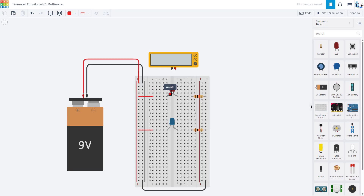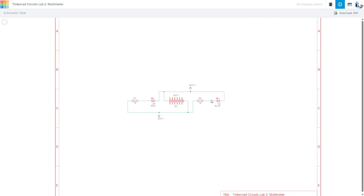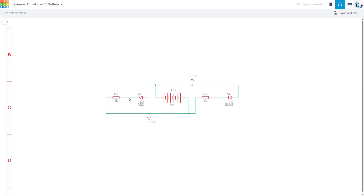It can be a coincidence that in some circuit diagrams, things wind up looking geometrically in parallel. For example, these two branches with the LED and the resistor are electrically in parallel to each other. If I go to the schematic view in Tinkercad, we can see it didn't line them up physically in parallel — if I had drawn this by hand I might have drawn the branches physically in parallel. But what Tinkercad did here is electrically equivalent even though the branches do not appear physically in parallel.